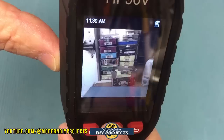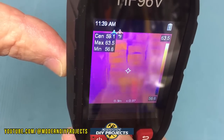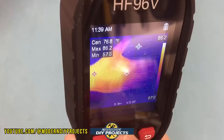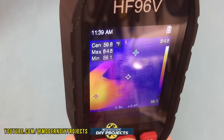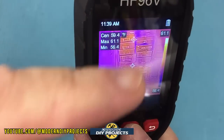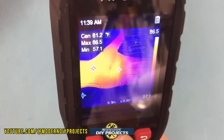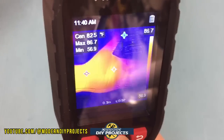Scrolling through: regular visual camera lets you orient yourself to the scene; thermal-only mode shows heat without much physical detail. Switching to fusion overlays both images so you can see far more detail about what you're actually looking at. The screen also displays center, min, max temperatures in the corner along with the palette, battery level, and time.